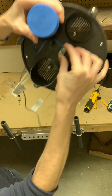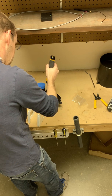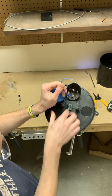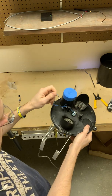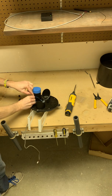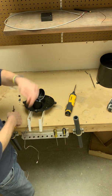So you can see it hasn't been done yet, but that's what it should look like. I'm just going to snug it right down, trying to go in the actual same hole. I want to cut it so it's away from what's going to be here — which is going to be the tipper, the rod, and all that. It's going to end up over here, and I want to make the wire nuts connect somewhere around here, just to keep it away from everything else. So I need at least this much wire — I'll probably go a little more just in case. You can always cut more off, you can't put more there. I'm going to cut it right here. That's my excess wire — unnecessary.